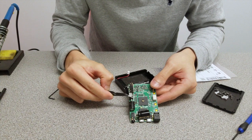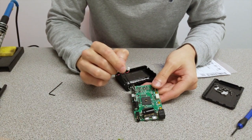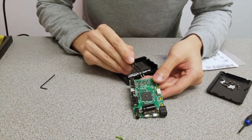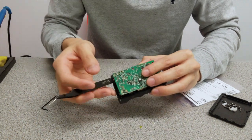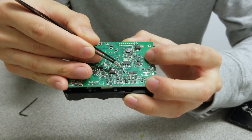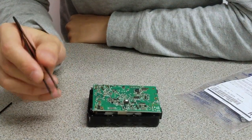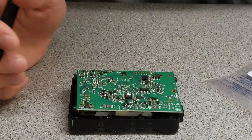I've attempted to change the capacitors and the resistors here. These are the power supply capacitors, these are the output capacitors, and these six resistors are involved in analogue reproduction of sound. Today we're going to attempt to upgrade this particular resistor of the Chord Mojo. It is the R330 resistor, with a resistance of 0.33 ohms, and it is a resistor related to the power supply module.